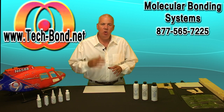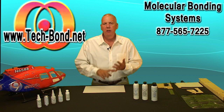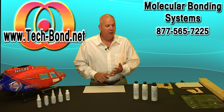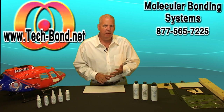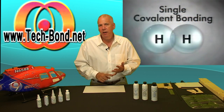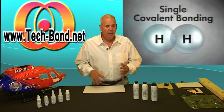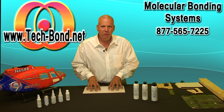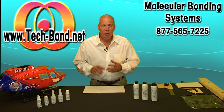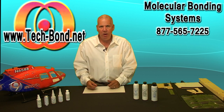The epoxies you can purchase at your local hobby shop — your 5, 10, 15, 30 minute epoxies — have some very good attributes and some bad ones also. First, it is a covalent bonding system, which is the sharing of electrons between atoms on your gluing surface. What epoxy does is it seeps into the pores and then it sets up and hardens. It's a thermosetting epoxide polymer, which means that once it sets up, you can't de-bond it — you have to break it apart or grind it out.